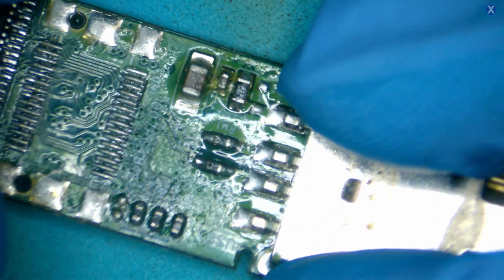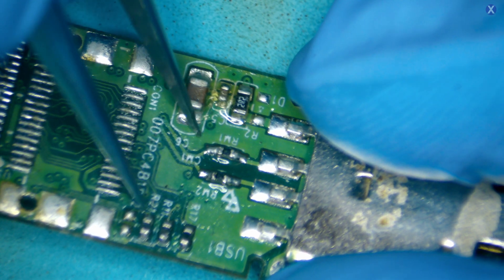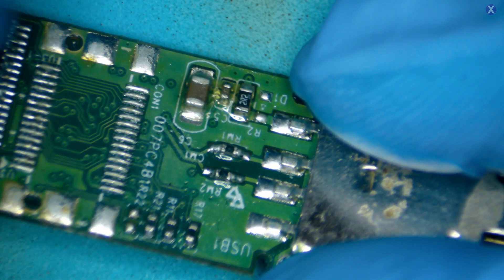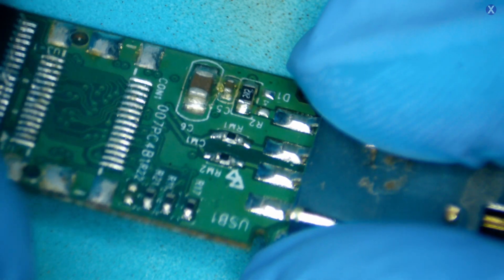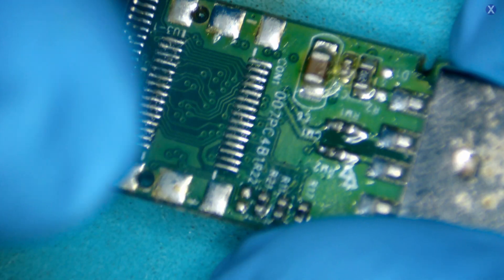Not maybe — somebody definitely did work on it. If you see a lot of that brown goop around there, that's flux, which means someone used a hot iron and possibly hot air and did some work there. So we need to see what's going on with that. At least the board looks to be okay and the damage doesn't appear to be local here, so now we need to go back and look further.